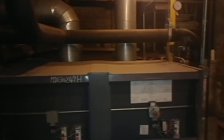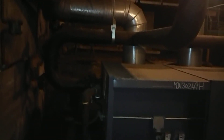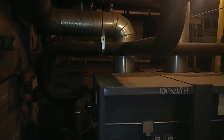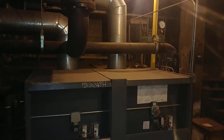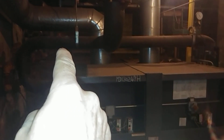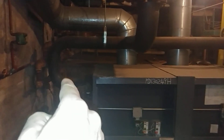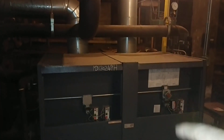One of the main problems of this situation is that it's got this really awful welded header. There's a loop there — that's where it comes out. It's not even close to what it should be as far as the piping outlet is concerned because there's no stress relief. What happens is the boiler starts out cold. The header, which is welded steel, starts out cold. The boiler fires and expands, but the header is still cold and acts like a clamp, putting stress on the section seals, which are rubber.